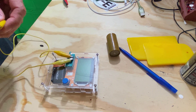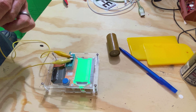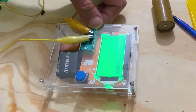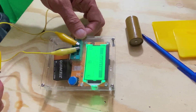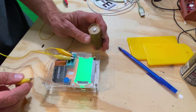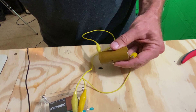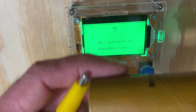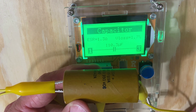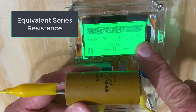Here's our meter. We're going to test and see what the leads have for resistance: 0.8, 0.9 almost — that's kind of a lot. Probably make these shorter. Let's test it again. Now it's 0.72. It's less than one ohm of resistance, so it shouldn't affect our ESR readings too much. Let me move this around so it doesn't have a reflection. We're going to hook this up to each side and test it. We have a little bit more of an ESR and a voltage loss across it of 1.7%. That's interesting — that's not good.